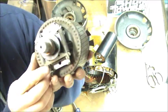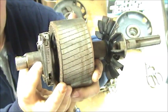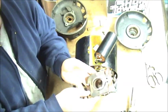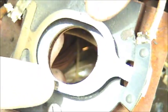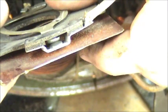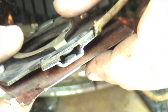Here's your centrifugal switch. In this position, when the motor starts or is at standstill, once it gets up to a certain RPM it'll snap in. What that does is bear on this raised surface here — let me zoom in a little bit. When that black plastic cap is down it holds pressure on this, closing that little switch. Once it gets up to speed, it'll snap that switch open and pull out your start winding. I want to make sure this is making good contact.